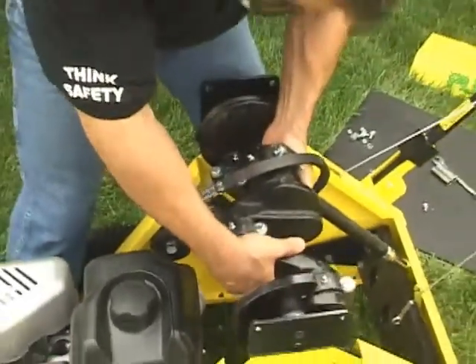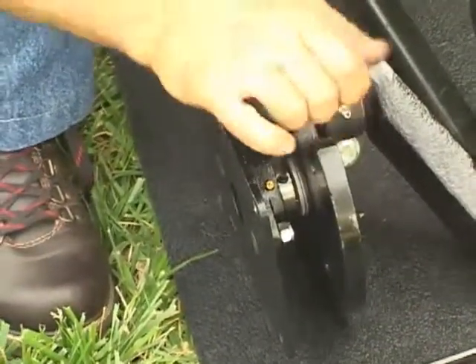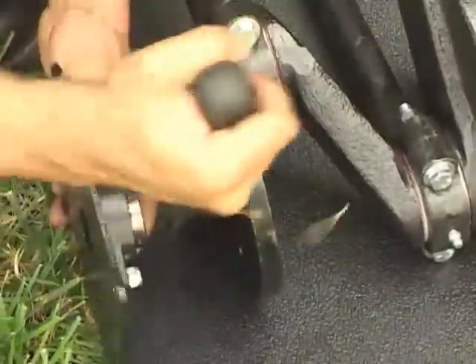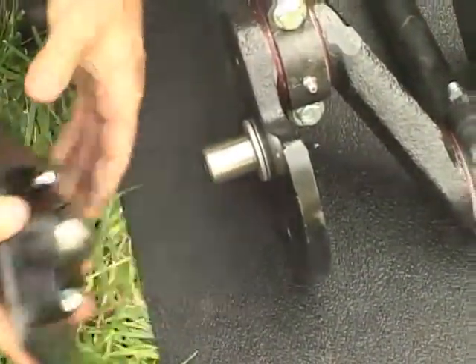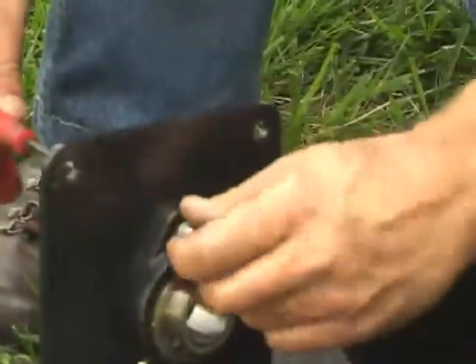The process of removing the crankshaft is the same to replace the bearings. To replace the cartridge bearings, loosen the set screws with an Allen wrench. With the bearing plates free, you can use an Allen wrench and an open-end wrench to remove the cartridge bearing.